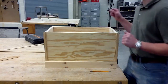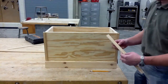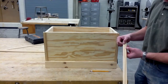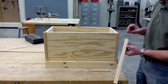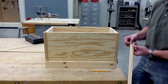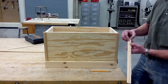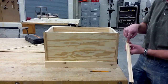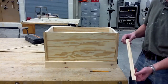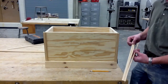The other thing I want to mention is that when you're selecting your hinge trim, make sure it isn't cracked at all. I was lucky enough that I saw this — it was a big enough crack that I noticed before making the cut. This was going to be one of my other corners, but as you can see it's basically ripped the entire length. When I would have nailed that in, it would have likely split the whole way down. Then I would have had to pull it out and get another piece, so this piece here is pretty much scrap.